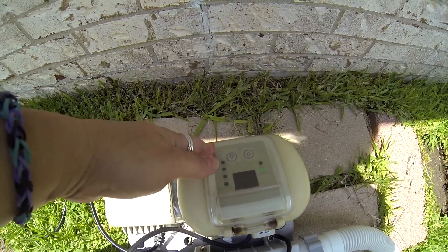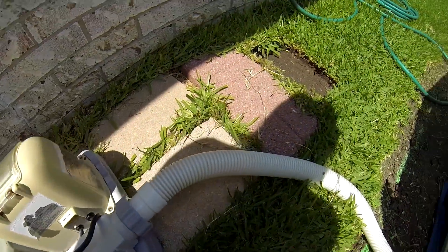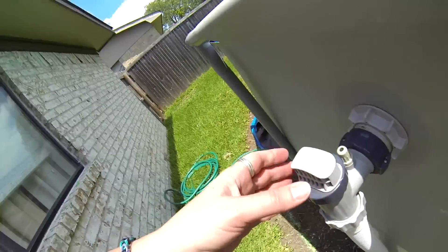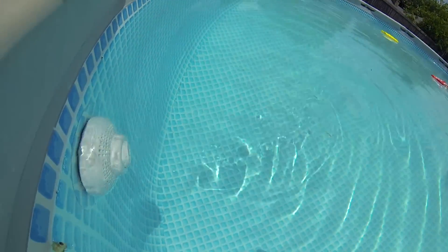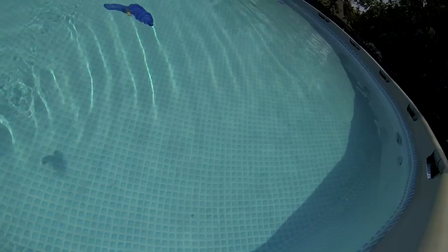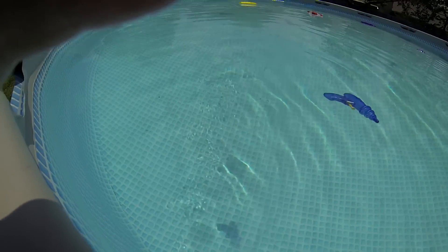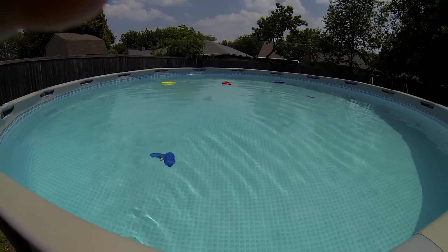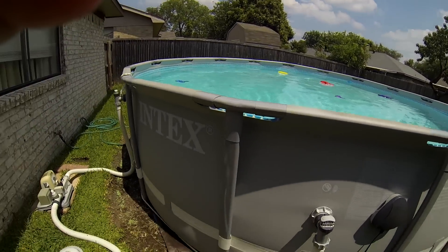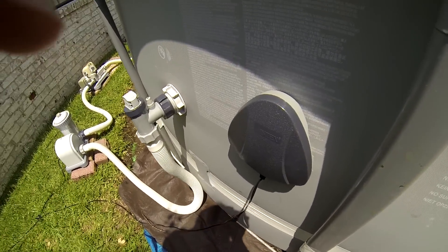It's important to make those hose connections in this order, or water will flow the wrong way which could damage the salt water chlorinator. My salt water chlorinator is an old one, but after a bit of cleaning with white vinegar it seems to be working just fine. The chlorinator needs to run for about six hours, then I'll test the water with a pool kit to see if enough chlorine was created. If everything is working, that blue-green tint the water has will go away in a day or so and will be crystal clear.